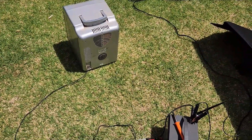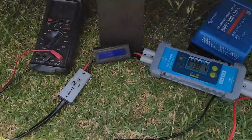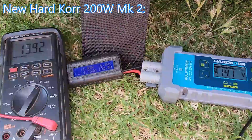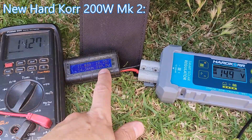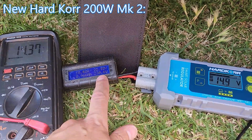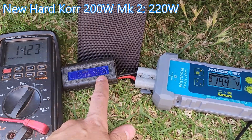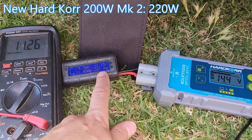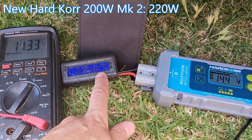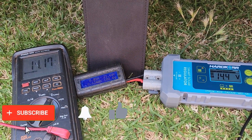For this test I had an additional load of a 12V fridge and a 12V soldering iron connected, and once it was running I temporarily disconnected the soldering iron. 230 Watts! 235 Watts! That's amazing — that is insane! How on earth is this blanket doing it? 22 volts pushing out nearly 10 amps. This blanket is delivering more power than it's rated to.